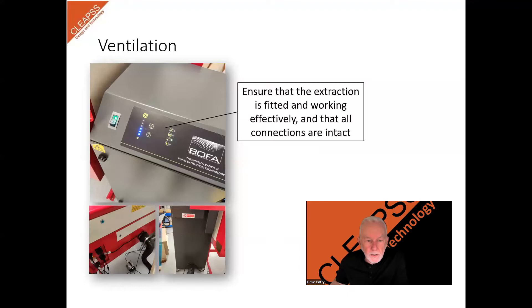Ventilation. Proper ventilation is essential when using a laser cutter. Ensure the extract system is correctly connected and functioning to exhaust any fumes or smoke generated during the cutting process. Never operate the laser in a confined or poorly ventilated space. All laser cutters must have effective extraction, either through a filtered system or through an extract-to-air system. Ideally, laser cutters should have both, with the exhaust taken out of the machine through a filtered cabinet and then exhausted to the outside where the fumes can be dispersed without the contaminated air re-entering a building, or being a nuisance to people outside the room. You may need to get clarity about how your extraction unit works, as some schools have been informed by their local councils that extract to air is not allowed due to local clean air regulations.